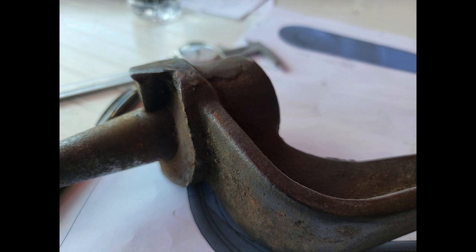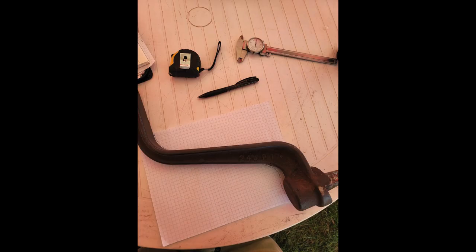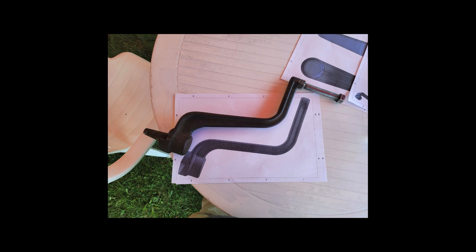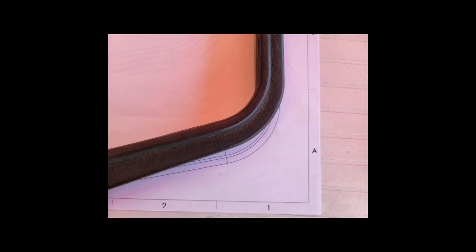In order to do that, we have to come up with a pattern. So what I started with was several pictures shown here of a tractor engine crank handle. Taking pictures and getting measurements on graph paper, after several renditions and many, many pages of notes and comments, I turned that into a model in a CAD modeling software that we were then able to print out and compare to the real-life crank handle.